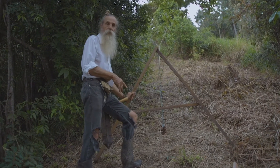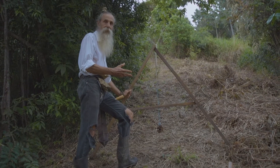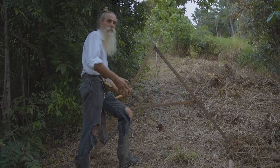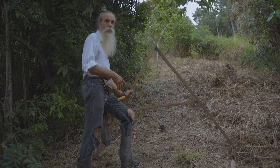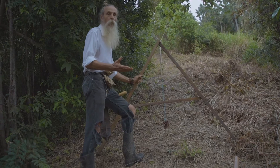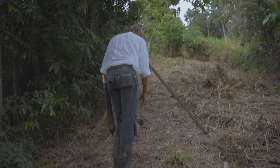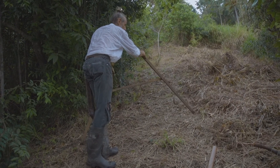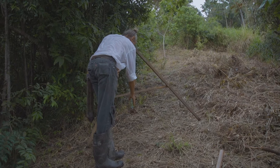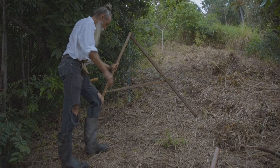You can also use the A-frame, and in this case we'll be using it to create the zigzag trails to maintain the same gradient on the zigzag trails as we go up. So you decide on an angle that you want — you want your zigzag trail to be at a particular gradient. You establish that and you make a mark.